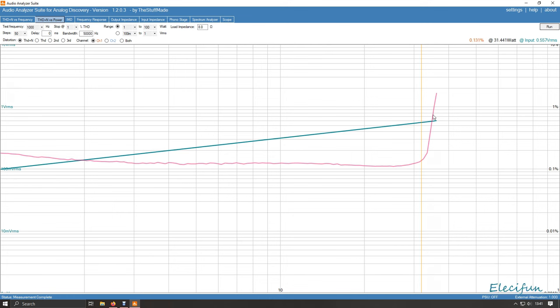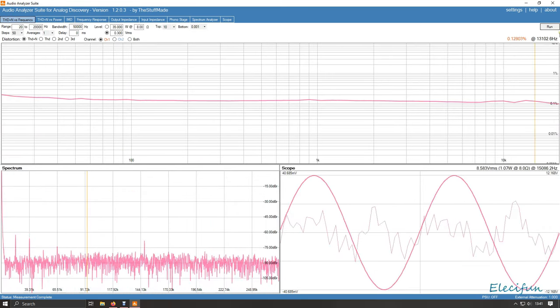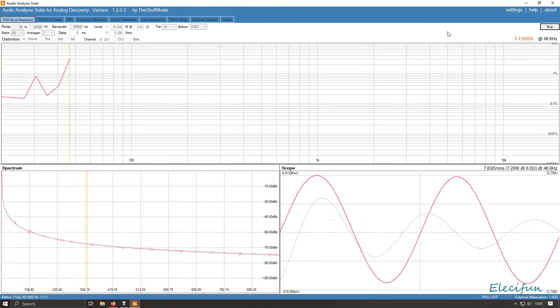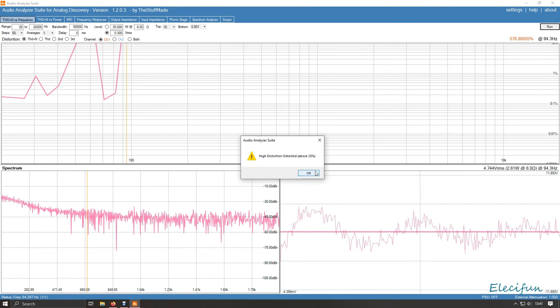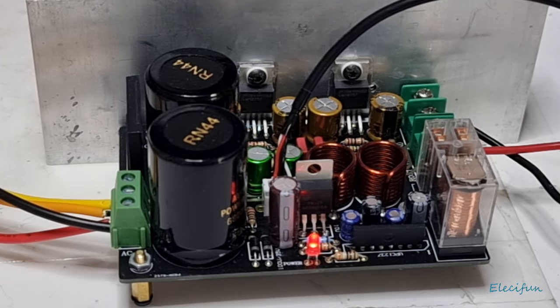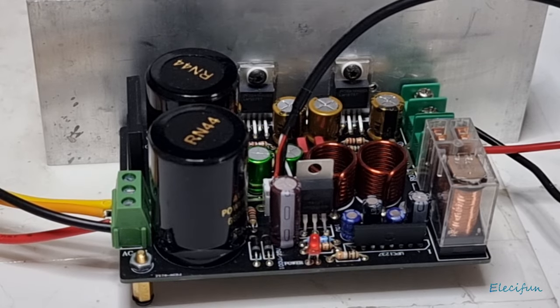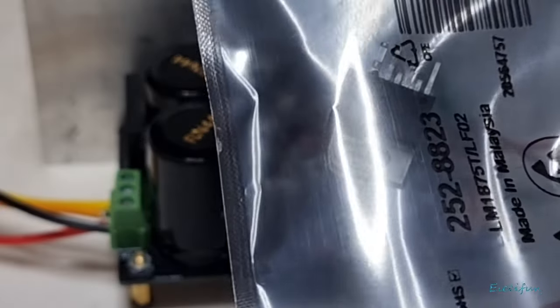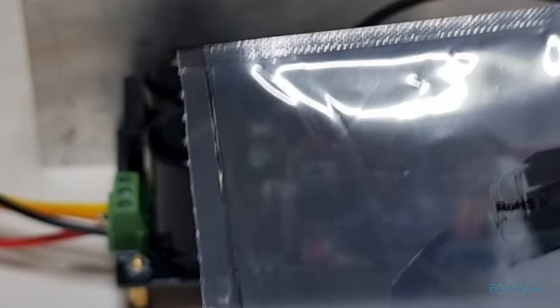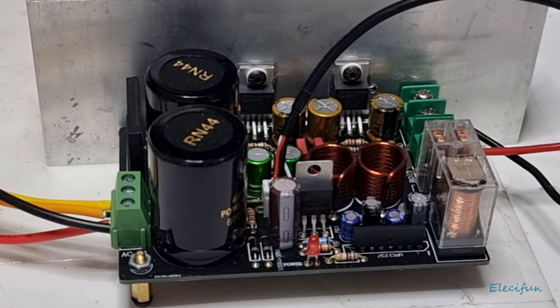The distortion on the frequency response shows 25% — it cuts out. So you can see it's an absolute fail. Weirdly, when you plug speakers onto it it doesn't sound too bad, but that is no good. These are the original LM1875s that came with the board. I've got two genuine ones delivered today from RS Components, so I'm going to swap those out and try this again.